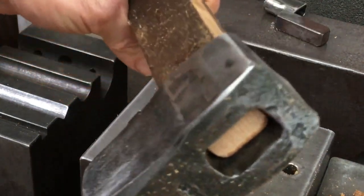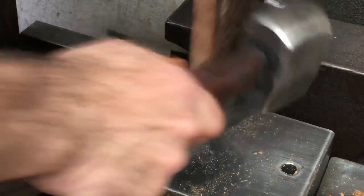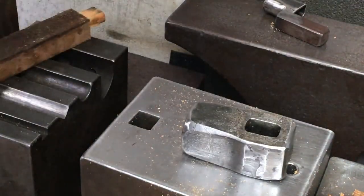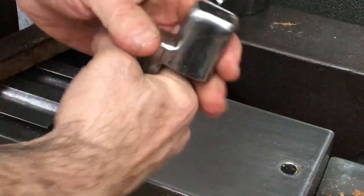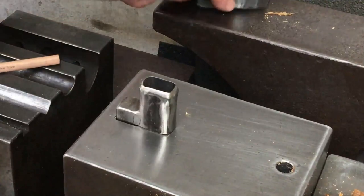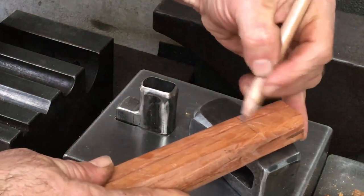It's not long enough, but that won't matter. I don't want to have shoulders that touch the bottom of my hammerheads — I want to taper the tenons and that'll bring them up even more. The main point is that I can get it fitted just right before I continue on to shape the handle. I'll try to go a little deeper on this actual handle wood and see what happens.